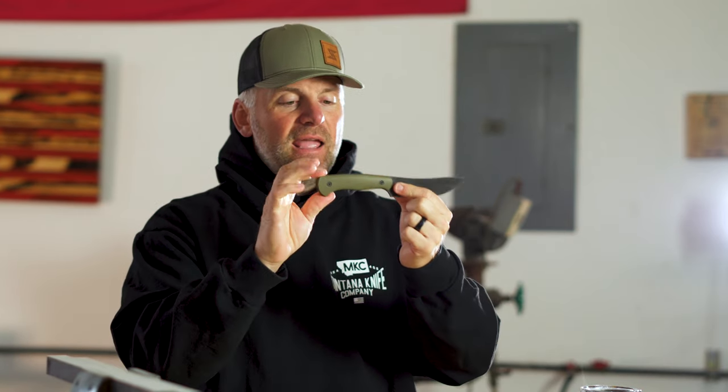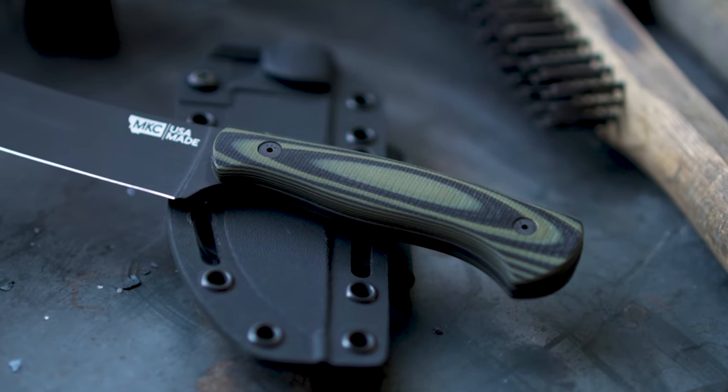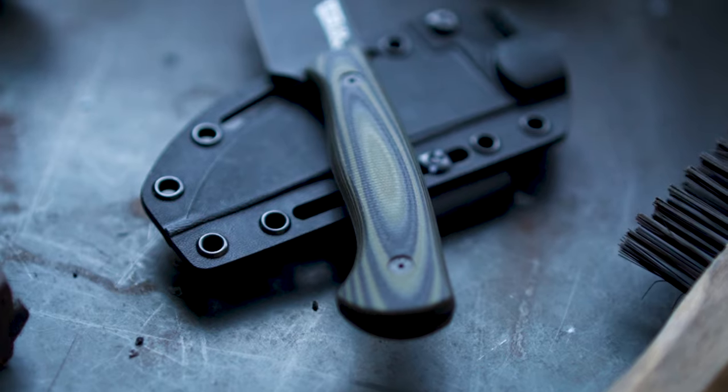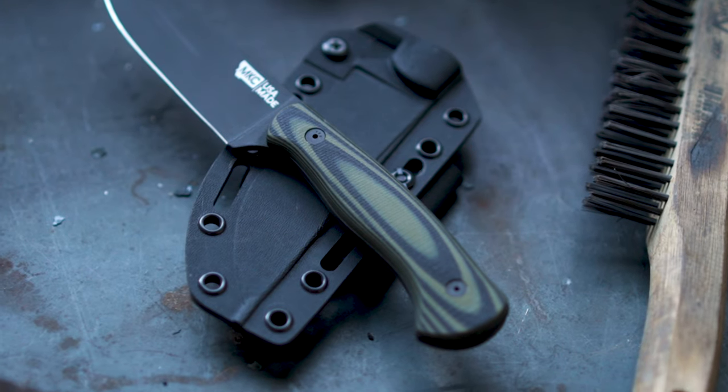So let's get to the handle. To me, skinning — especially if you're doing a lot of it — ergonomics are incredibly important. Is that knife comfortable in the hand? You're going to notice we have no hard edges, no square edges. Even back here on the back of this handle, we've softened this with just a mill bit around. You'll see there's a slight chamfer on the front and the back. This handle is nice and smooth all the way around, no sharp edges. But we've also left the milling marks on our G10. There's a little bit of texture to that, so when this thing gets bloody or wet, snowy, frozen — you've actually got some traction on that handle.